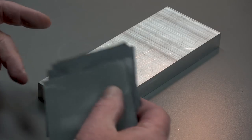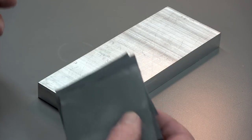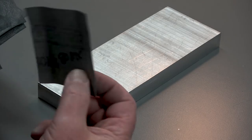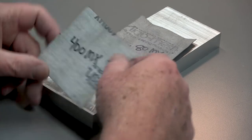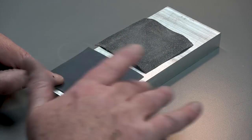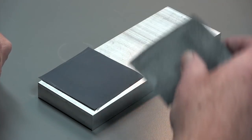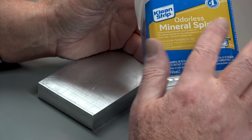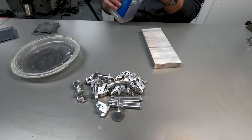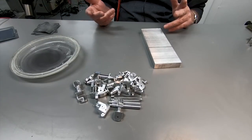It comes in a wide range of grits and you want to make sure you buy the entire range, because the manufacturer has gone through a lot of trouble to figure out what progressive set of grits are right for this particular paper. In this case, the paper runs from 80 up to 400, and 400 is — you can't even feel it, it's like a sheet of paper. The numbers don't matter really for what we're doing. What does matter is that you progress through them in order. What I found works best as a lubricant is mineral spirits — I use the odorless one. I pour it into a little bowl so I can keep wetting the sandpaper and cleaning off the grit left behind from what you just sanded.